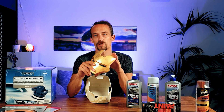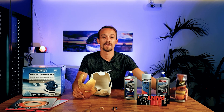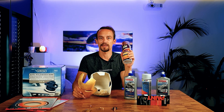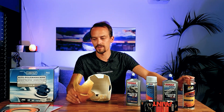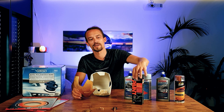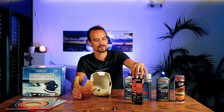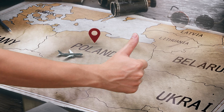After that I'll give it a wash with the electro cleaner to remove all the waxes, then apply my copper conductive paint. After that I'll sand it again — depending on roughness I'll go with wet 600 grit. In this polishing kit there's a 3000 grit, so I'll wet sand with 3000 grit, then polish again with rough polish, then again with fine polish.